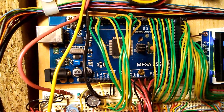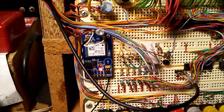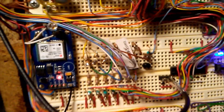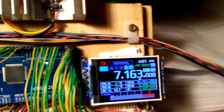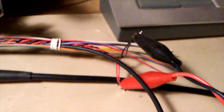I was able to obtain a new Arduino Mega 2560 and rebuilt my front panel, so that's all back and working again. This time I designed and built a protection circuit on the input that clamps the possible voltage going into this thing to five volts, so that should hopefully protect it from me. I've also cleaned up the cabling so I just have one cable that comes out onto a 25-pin connector.